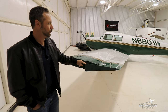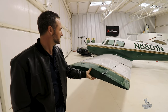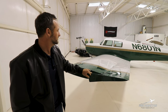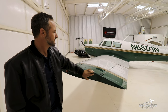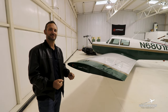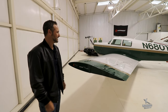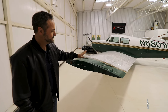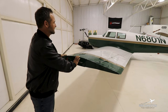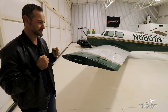We've got a wide aileron with very short throw — you can see how little it throws. The cockpit controls move very little from side to side at full deflection, which is really interesting. Flying a Cherokee, you almost have to go full lock. The spar goes from tip to tip — you can actually move the wing tip just ever so slightly and see the other wing move. It's very responsive, very resilient, and planted.